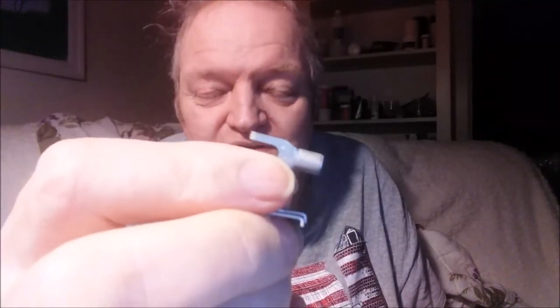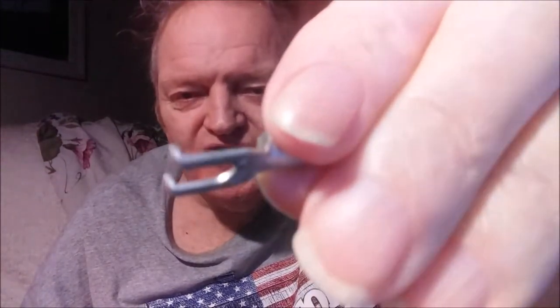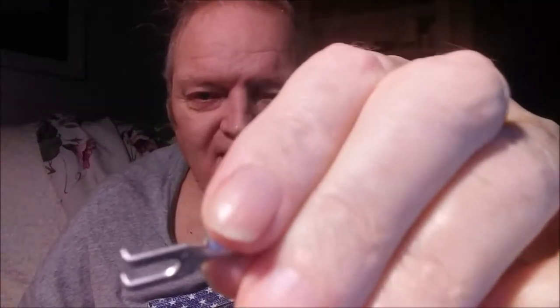Here's another related little item. Everybody recognizes a fork terminal — you put it on a wire, you crimp it, you can solder it, you can crimp it and solder it. These are different in that they are what they call forked flanged connectors. You put this in, it opens the screw up enough that the little tabs on the end will go under the screw head, and when you tighten it back down, even if it's loose this can slide around but it can't get out.